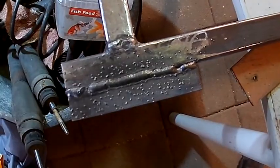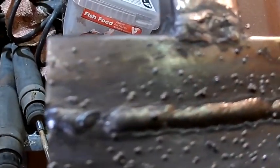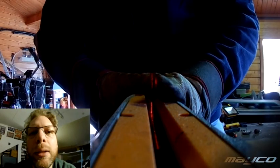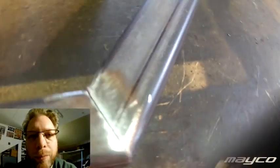You get a lot of chunks flying off the torch, a very strange sound — it sputters, it crisps, it splatters — it sounds completely different. Another thing I really had to get used to is that a flux weld looks horrible. There's this discolored dust all over it, and there's a big slag on top. I think it's a little bit similar to when you weld with stick, but I haven't welded with stick much so I'm not entirely sure about that.